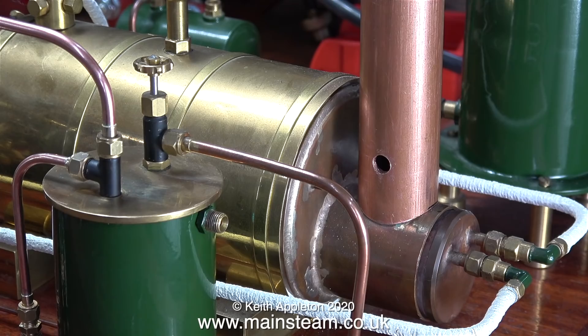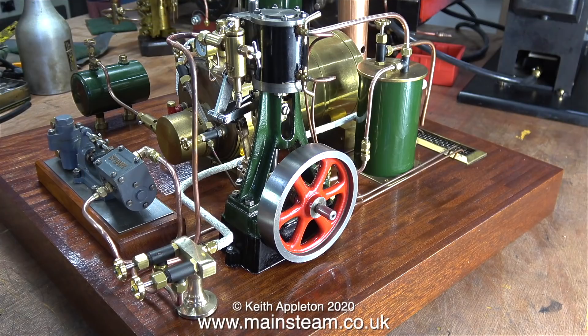In this clip I've removed the steam union because before fitting it I need to drill it out a bit larger so the steam exhaust can flow without any restriction. In a previous episode I asked if anyone could spot the deliberate mistake with the piping. One viewer sent a message but was confused about which pipe was which — inlet or outlet. That will become more obvious when I lag the live steam pipes with some string; a clue is that the dirty uncleaned pipes are the live steam pipes. On the steam engine there's a displacement lubricator which provides oil for the cylinder, but the steam pump needs oil for its cylinder too, and I'm not seeing a displacement lubricator on the pump — I haven't fitted that yet. I can see where it's going to be fitted, and that's why I needed to make the pipe complete first. At least it gives people something to think about during this lockdown period.